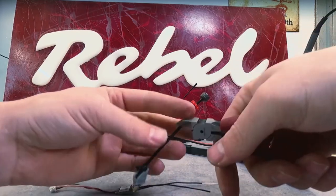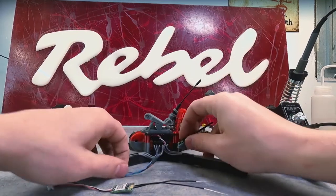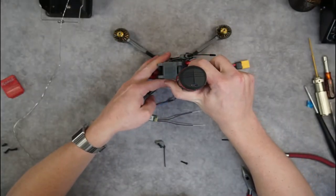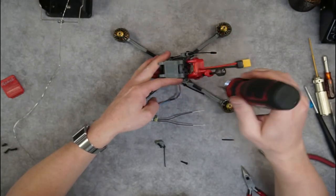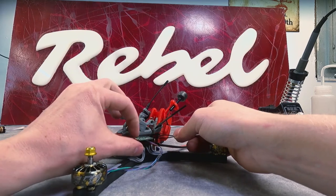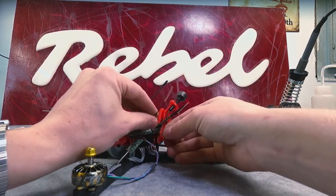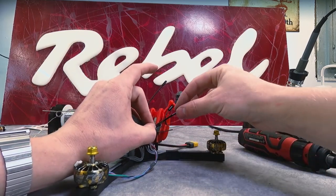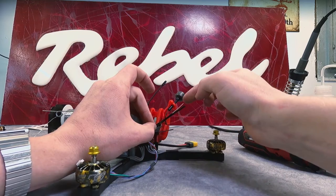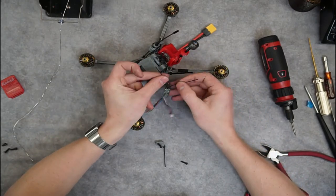Now that I've got that pulled, I'm just going to roll it up a bit and cut it here where the antenna bends, so I've got that semi-rigid piece of zip tie material. Going through the backpack post into that standoff. With the receiver double stick taped to the top plate, I can now take my antenna and place it on this zip tie. I can secure it with electrical tape or with heat shrink tubing — which is the method I prefer. Just put the heat shrink tubing over the top of the antenna and shrink it down. Now you have your 2.4GHz antennas up away from the body of the quad and out on an angle, so you can maximize reception performance in any orientation.